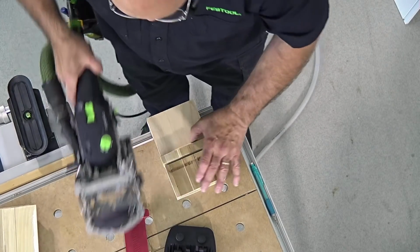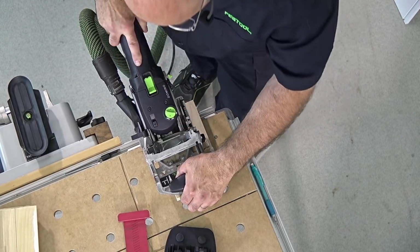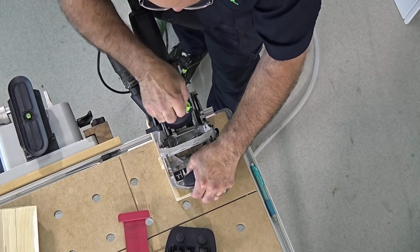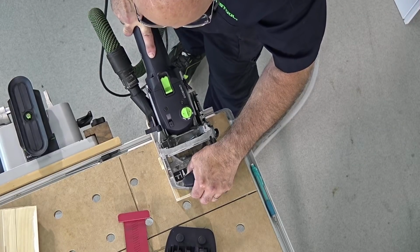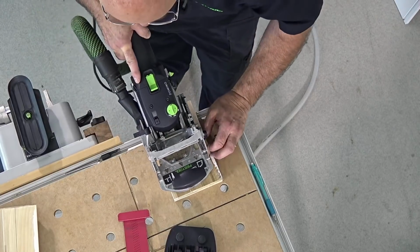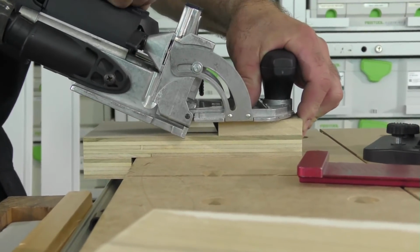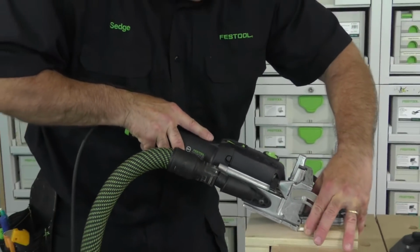So I'm just going to come right in. I'm going to make sure I hook that piece. Make my mortise. I'm going to come right in here. I'll do this one loose. I'm going to come over here, do this one loose again, making sure I'm resting on the bevel. Then I'm going to come back and do that other side tight. But make sure that plate's on there and that's tight.